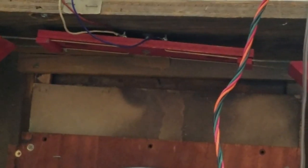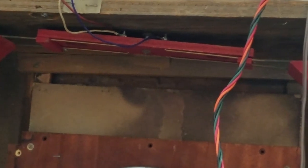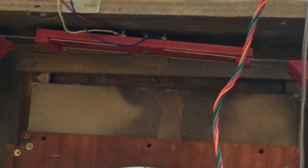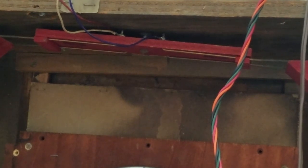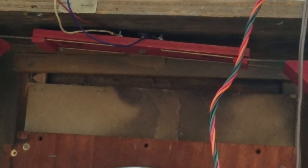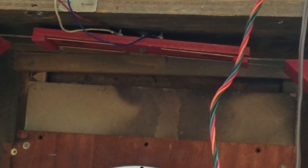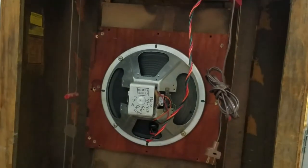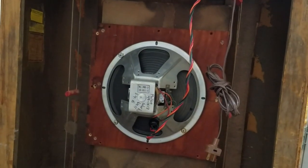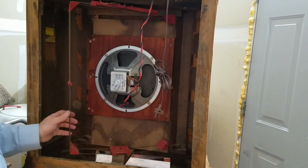And then you look up at the top and it's very similar. There's a tall bushing that goes through that one, about 3/4 of an inch tall. And that bushing works like the bushing on the grommets, where it doesn't allow you to tighten the wood frame of this antenna up against the bottom plate of that chassis mounting board. What it does is it squeezes that bushing and the antenna still turns freely. So let me show you. By the way, there is the speaker mount right there. It's all mounted up.